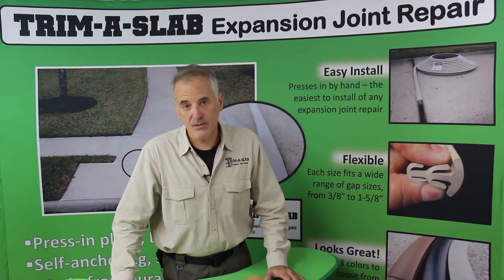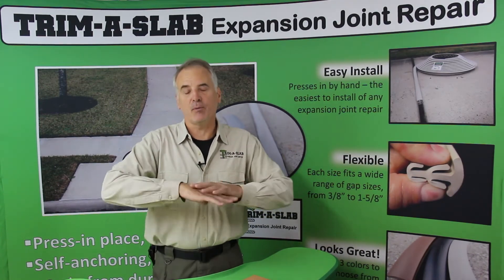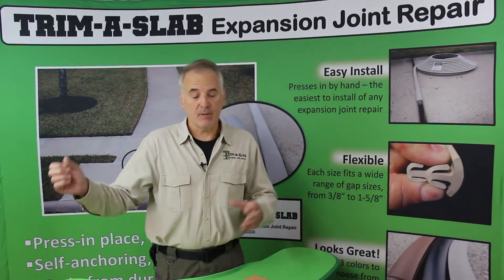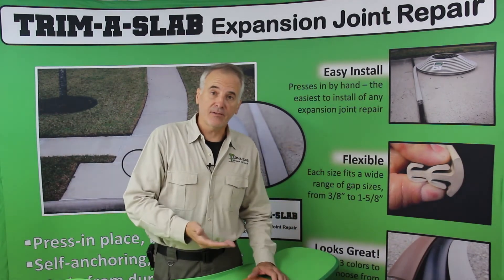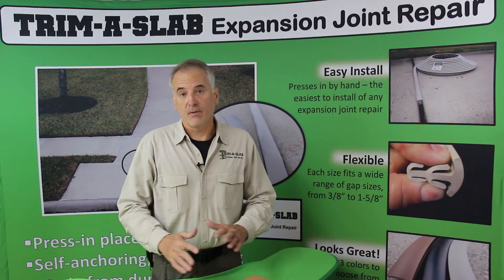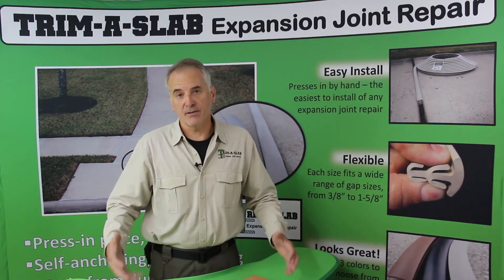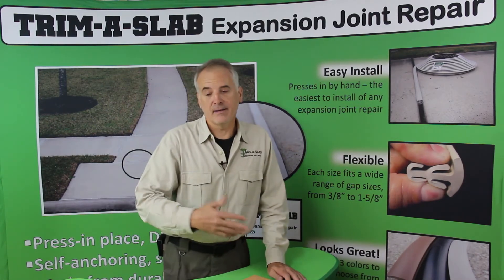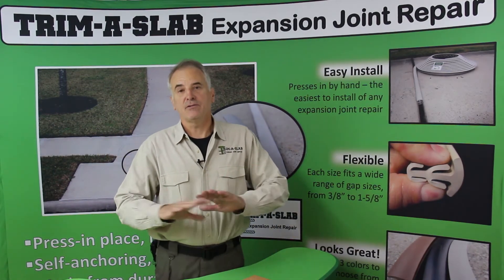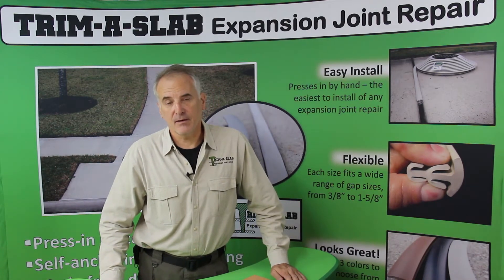The last reason, which most people don't even consider, is the slab is only as good as the soil beneath it — it's basically sitting on a prepared bed of soil. If that soil is washed out for any reason — pressure washing, rain sheeting down the driveway, or ants and insects carrying it out from underneath — that slab becomes unsupported. Heavier vehicles will crack it and begin the breakup of your entire driveway, which will be a very high dollar expense. So you want to maintain these joints largely sealed to help maintain the integrity of your driveway.